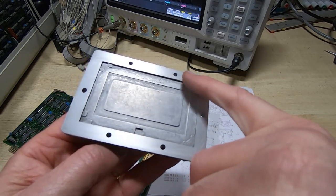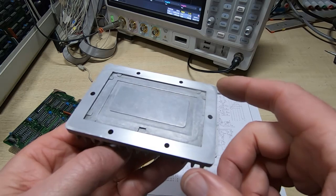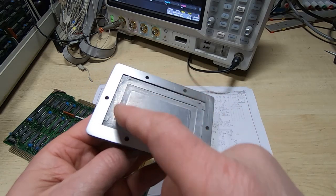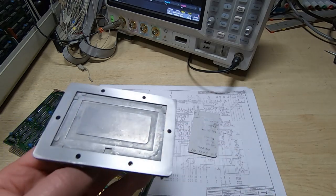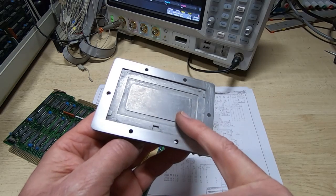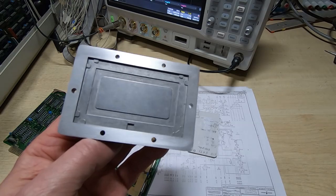I've taken between 0.1 and 0.15 millimeters off depending on where it was, so it's now even all the way around and flat. I did that with emery cloth on a piece of glass plate. In theory, this should now put a bit more pressure onto the hybrid module and push it slightly harder onto the zebra strips evenly all the way around. I'll put some fresh heatsink compound on, refit this to the board, try it in the machine, and see what happens.